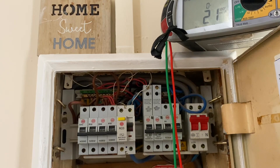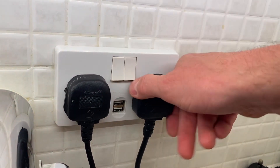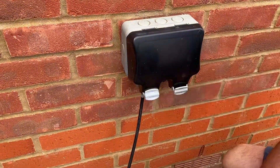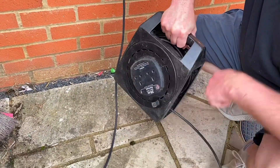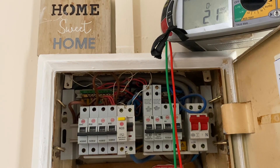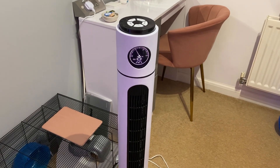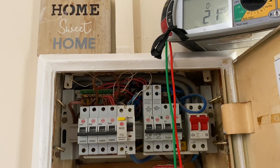It's also important to communicate with the customer. Let's assume we've done the clamp ammeter check on the natural earth leakage and it's fine. Usually when an RCD is tripping intermittently, it's down to a faulty appliance. This is where you talk to the customer — is it happening at a certain time? Is it when you've plugged in a particular appliance? Maybe over the next few weeks, keep a list and keep an eye out — is it happening at a certain time, with certain appliances, or when using too many appliances together?